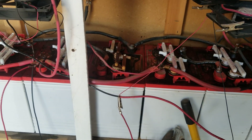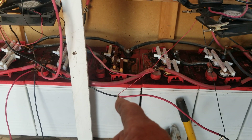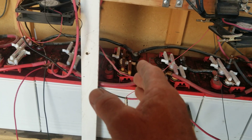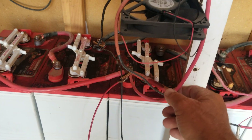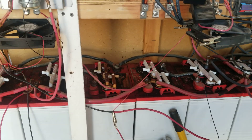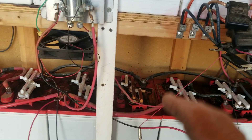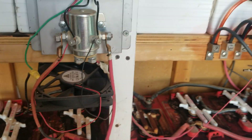I've been getting some sediment buildup on the caps here, and that's telling me that battery has been taking on an extra load. I'm going to have to check out why that one battery has it — it could be because of this connection right here, which is the dump load connection.